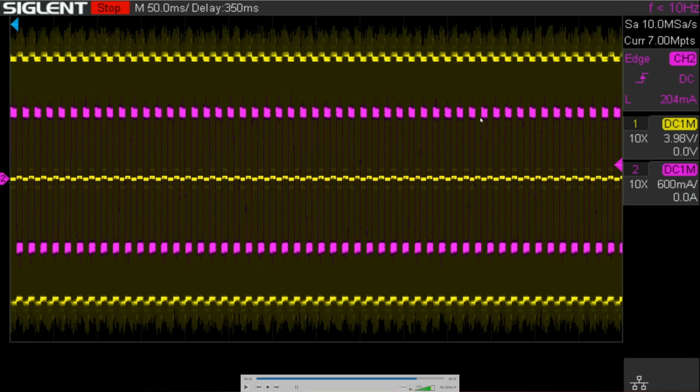And if you could see the scale of this, you would notice that this is around 1 amp here, and this is around negative 1 amp here. So we're getting positive and negative currents flowing through this winding. What's interesting though is if you counted each of these little dots along here, you would be able to count and see that there's 50 of them. And that is a very specific number because of how full steps are correlated with a mechanical revolution of a stepper motor.